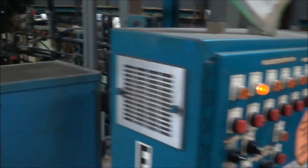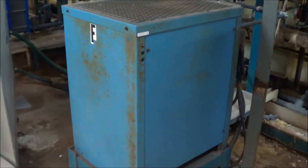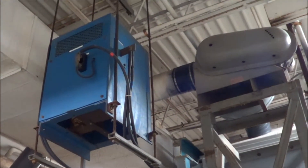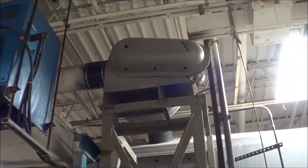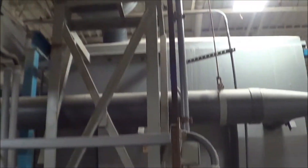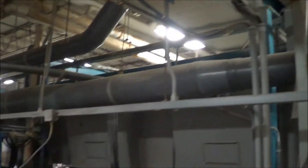On the back side of the control panel, you can see this was the original rectifier — a 300 amp, 24 volt unit. There is also a ripple filter for that unit that feeds into one of the Type 2 anodizers. There is a booster blower that draws off the front half of the line and pushes back to the fume scrubber that we will show you.